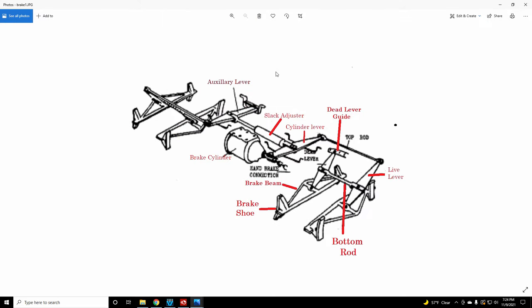Now you see the brake piston — this is a standard arrangement. There's various types of brake rigging and arrangements. This brake piston is attached to the underside of the rail car, or sometimes up on the center sill, various locations. Basically what you've got is a big piston that comes in and out — that piston can travel out approximately 12 inches. It's got a big heavy duty rod stuck in it, and it's the only rod on the brake system that actually pushes instead of pulls. All these other brake rods pull — they pull a lever.